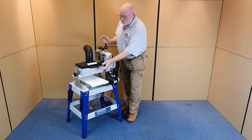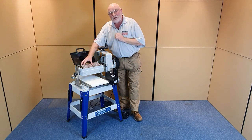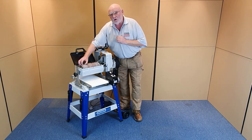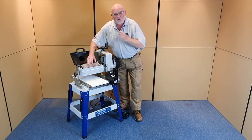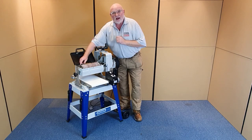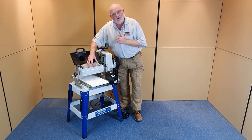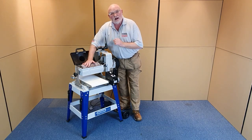What can we tell you about it? Well, if you look in here, we have a large drum — 132 millimetres in diameter by 260 in length — and that has a wrap on it. What's a wrap? The wrap is the abrasive material. That's the new name for you to remember: the wrap. That is 82 millimetres wide and 1550 millimetres long. That's a hell of a lot of abrasive rotating on this drum at 1440 RPM.